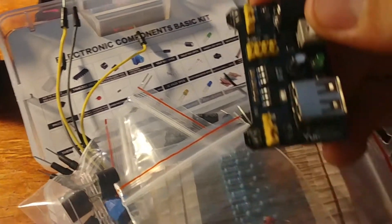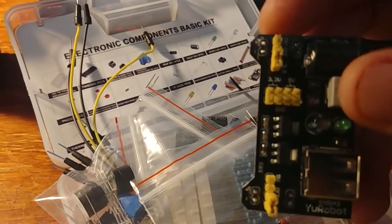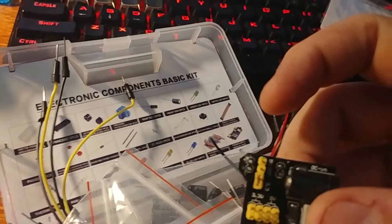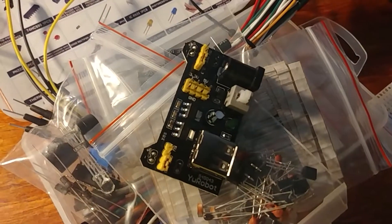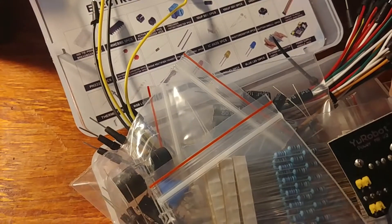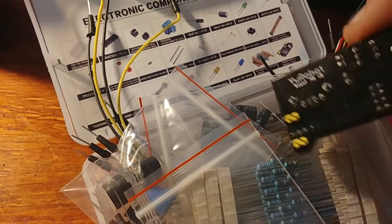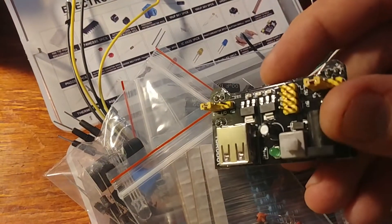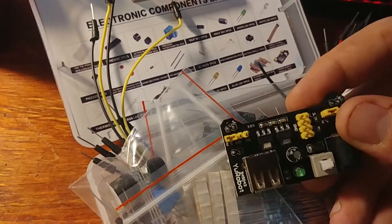Only one crooked component — not bad. Right here behind the switch you can kind of see it's a little off. Nothing's tombstoned, though. Oh no, there's a crust mark. See it up here at the top. There's a little bit by the other spot too. At this point I can see my fingerprints. This is totally acceptable — look how shiny it is. Not bad.